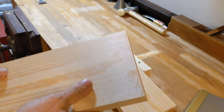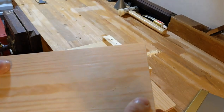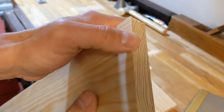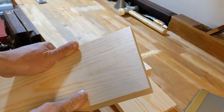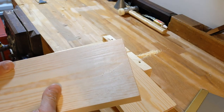So I popped a knife line around that, and all you need to cut things to length is a knife line. You don't have to be chiselling in little gullies and all the rest of it — it's just not necessary. It's largely a waste of time, which is something I'll come on to in a future video. You can see there, nice and clean. So yeah, no problem, that's going to be fine for joinery.